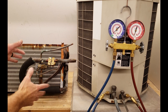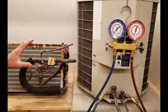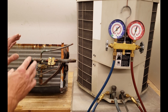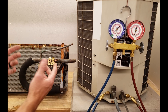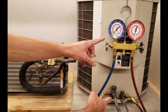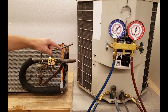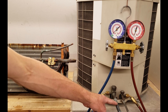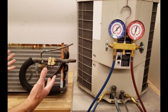There are a few circumstances where you may want to check the superheat at the indoor coil. One example is a high-velocity system coil with a thermostatic expansion valve that has an adjustable stem and an additional pressure port to check and adjust superheat. Another is when troubleshooting — if you're reading a normal to high superheat at the outdoor unit, you might check the temperature on the indoor vapor line to see if there's a difference at that point versus where it enters the outdoor unit, indicating a pressure change or other issue.